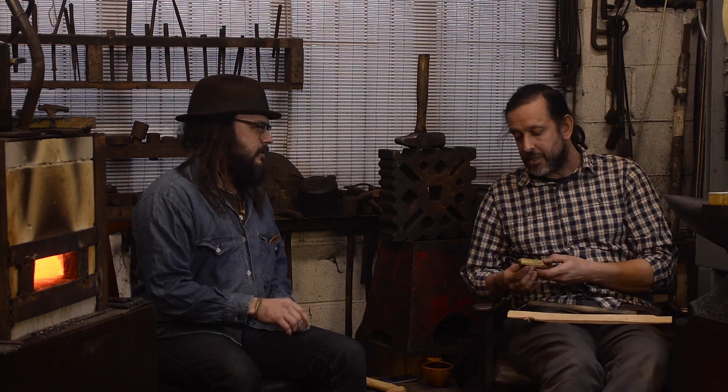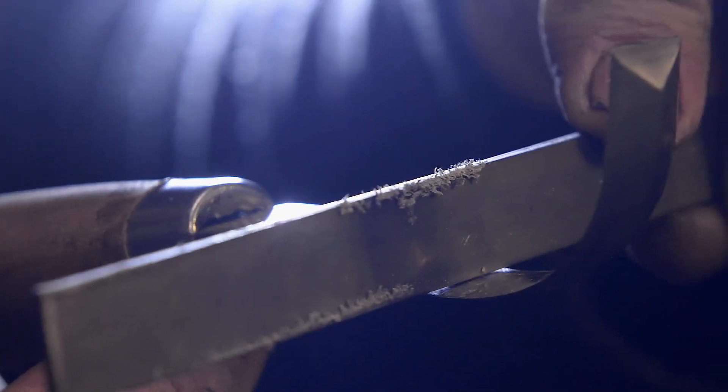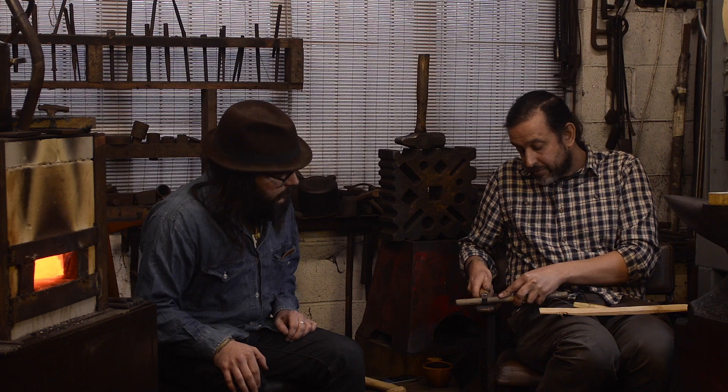That's quite different from most opinions I've heard from other tool makers and other videos online — they always tell you to leave the inside bevel alone and only sharpen the outside. But yes, that's true, but my edge geometry is different to other blades. We've got this convex bevel on the outside which is difficult to hit, and the inside is easy to hit, so you're just doing the easiest thing. With a Mora knife or a spoon knife curved on the inside, I could be rubbing away on the inside and not actually hitting the edge. That's the whole point — my blades are different, so it's a different technique.